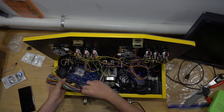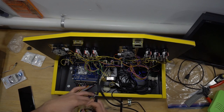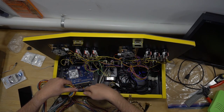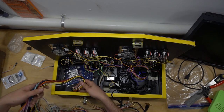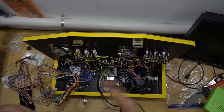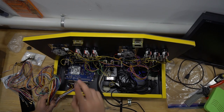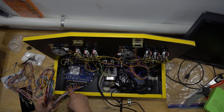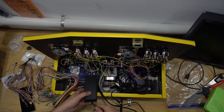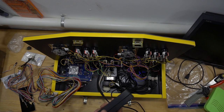I might tap off into the joystick or just into the first one. This is a JAMA harness so there's a lot going on here. But luckily with the way I'm going to do this, I do not need all of it - it's going to be shortened down but long enough so that if anybody ever needs to lift the panel open, there will be enough wiring. One little upset right now is that this Pandora's Box came with zero instructions - no breakout, no wire breakout. Our JAMA harness is in Chinese. I can at least identify my power. If you were doing an actual arcade power supply, we did get an external power supply for this build and I'm praying that the brick will fit somewhere inside.